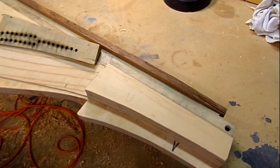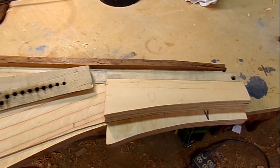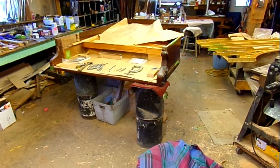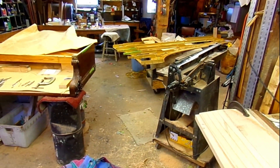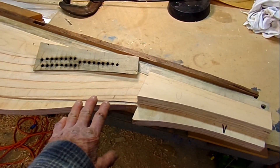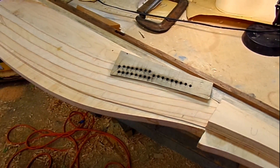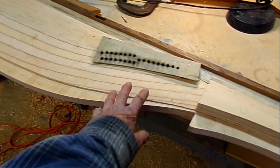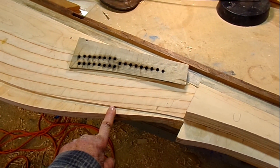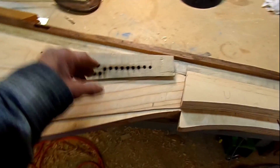This piece here — I decided to put it in now. And when we put this assembly, just set it there into the case, we're going to drop the plate to make sure it fits right. What I'm hoping is, while all this assembly is in the piano, I can fit these top pieces to the plate by sliding the pieces in this way, down to the plate. I just cut it in half on the bandsaw, and now I have to shape it like this, which will be pretty easy. Gluing it in here will hold it in place too.